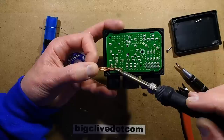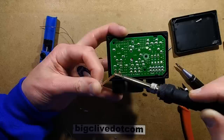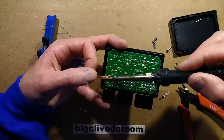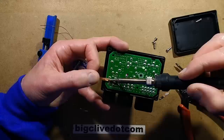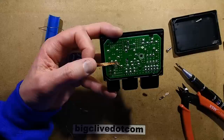I'm going to just desolder the first few connections and then pause — actually I might pause now, because I've just completely stuck the desoldering braid onto that solder joint. This is one of those applications that, because they're a fairly chunky connector, it might benefit from a heavier-duty soldering iron as opposed to the light-duty electronic one. That's got that connector more or less desoldered.